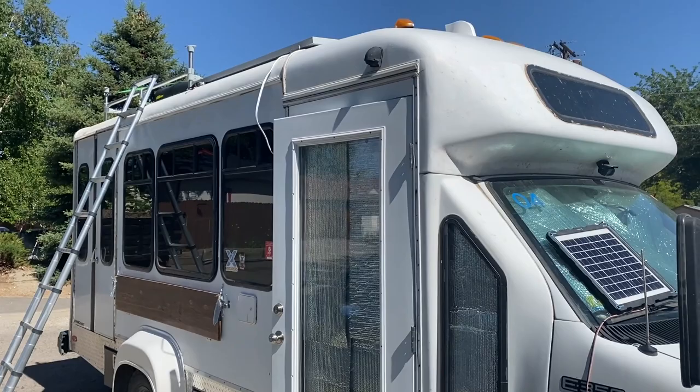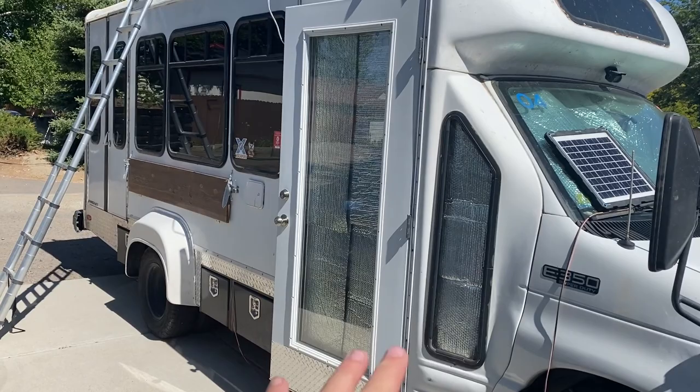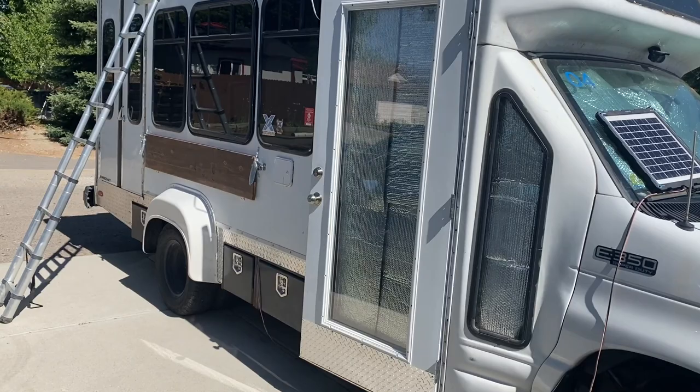If you're going to order your door early, order it with tempered glass. Preferably, if you have roughly a 36-inch opening like ours, order a 34-inch door. Then do a little bit of in-framing on both sides. Use the jam that comes with the door and install the whole thing. Have it outswing. Order it exactly like you want.